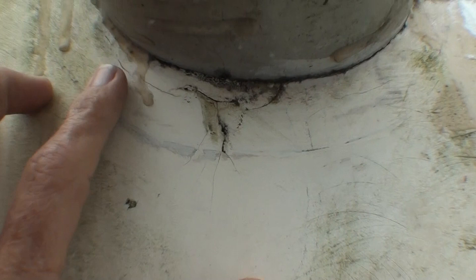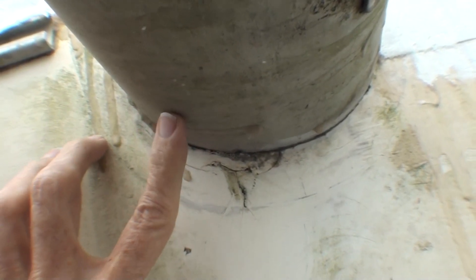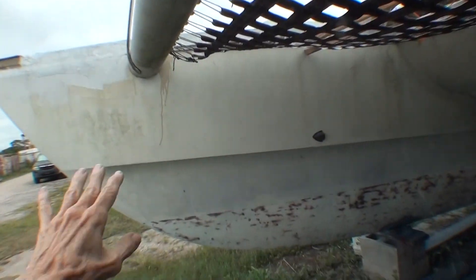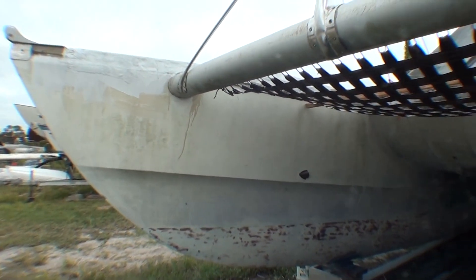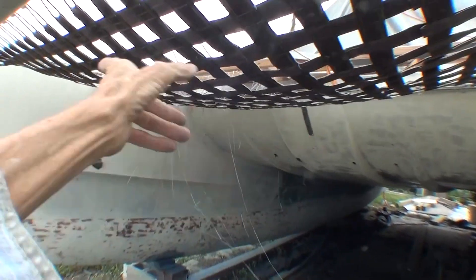The attachment here is not too bad, but it looks like there has been some stress — this should probably be reinforced. I'm not sure whether this area should be trampoline or not. I asked Trevor if waves splashed through here and he said yes, but I never really specified whether that was spray bouncing off the hulls or whether waves actually go over it — and if it were covered, would a wave come up and actually lift the boat here and create structural problems? I'm guessing no, but if anybody has an Iroquois catamaran or similar, is there some reason not to replace the trampoline with deck?